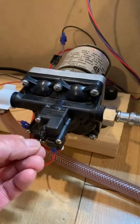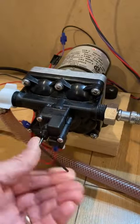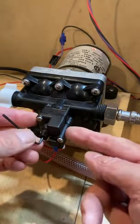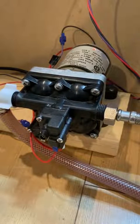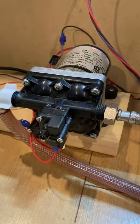So if you see this with your installation, the key is to turn the switch clockwise so that the pressure switch setting is increased. By that, I mean that the switch remains closed circuit, and your IRV WPC will now be able to smoothly control your pump throughout the whole range of operation. Thanks for watching.